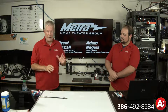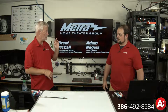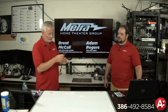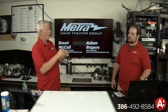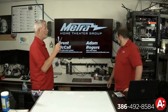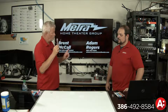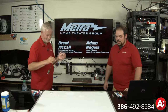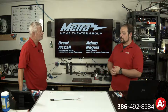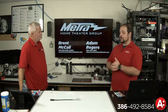As we're going forward, right now we have 3 digital video channels. D0, D1, and D2. D3, which we pushed off to the side here, has been the clock channel. Now, this is what's going to get a lot of guys in trouble as we go forward into HDMI 2.1. And why is that, Adam? Well, we talked about this earlier, that sometimes we have calls where people have a subpar or lower quality HDMI cable and they're having troubles with it.